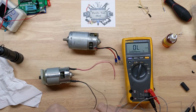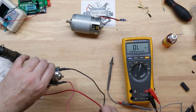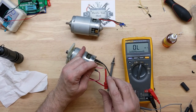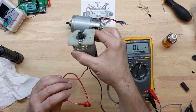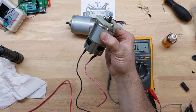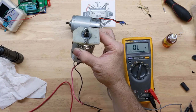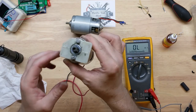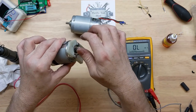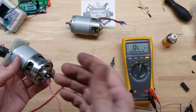Reading 1.2 ohms, so we should have a low-ohms load. Let's see if a 32 volt, 5 amp supply runs it up. It might current-limit for a minute. Only about 1.2 amps once it gets running — that's pretty good. It spins free, so hopefully he'll be able to get that pole saw back working again.